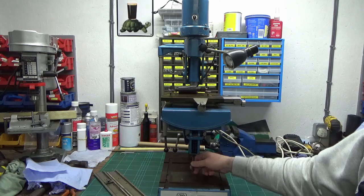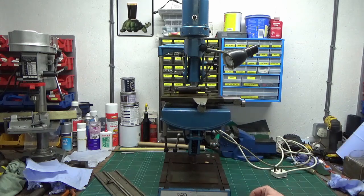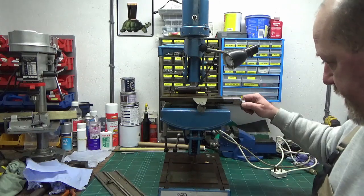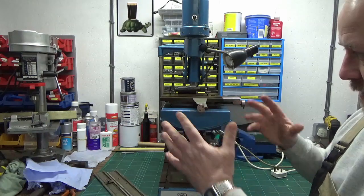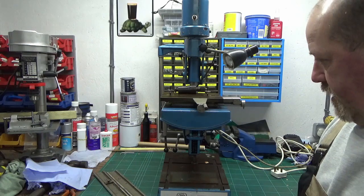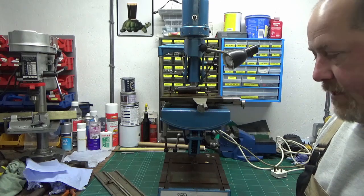Under this whole table surface there are lots of bearings and some round rails - the bearings sit at angles and that gives the table its movement. Doesn't feel too bad. I'm going to get the tools out and start breaking it apart. I'll bring you back periodically. There are a few bits I need to remake - the handles on the axes are all broken, and one's bent slightly. There will be some machining required to bring this back to a decent workable state, but nothing too serious.